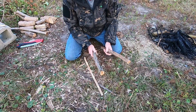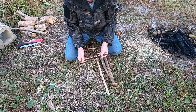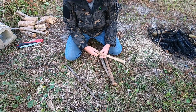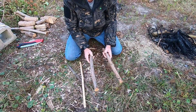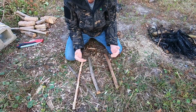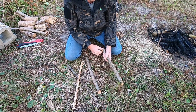Alright guys, so what we have here — we have our buck saw blade. This is a 21-inch buck saw blade. We also have a cross member — this is a softwood material. I don't know the name of the tree but it works. And I also have cedar — these are going to be our uprights. I wanted something heavier, harder wood for my uprights because the last one I created was made out of softwood and it bent very easily and I started getting rocking over a period of time.